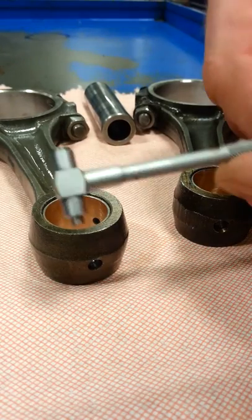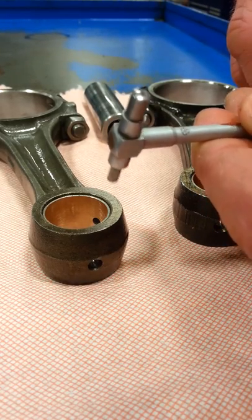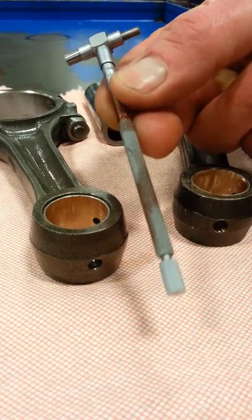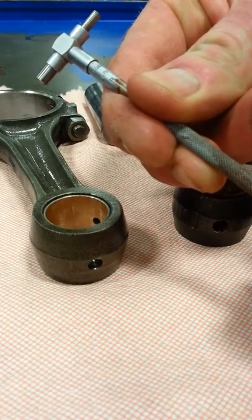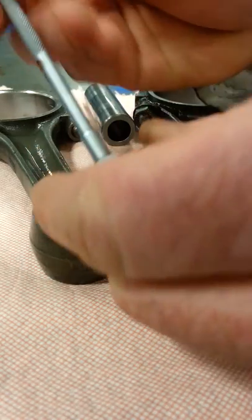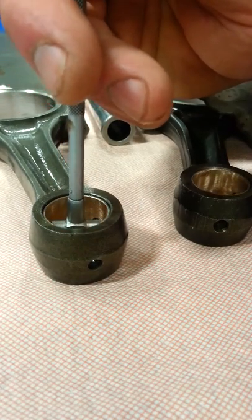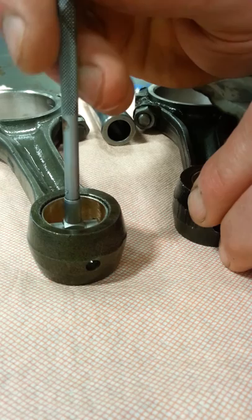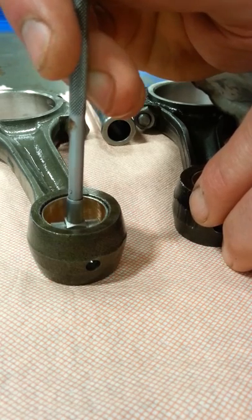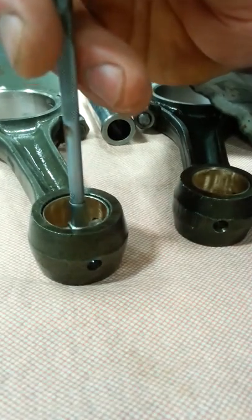What I'm going to do is take a small hole gauge or a telescoping gauge. You can see that if we operate this and open up the end of it - there's the whole tool. If I just open that end, I can get this tool to move out and fit the bore. The bore in this case is the bushing that I've replaced. I want to put it in and release it, and just rock back and forth, making sure I center the tool and that I'm not in any of the holes for the oil like we talked about earlier. And just lock the tool.